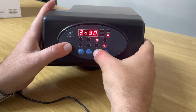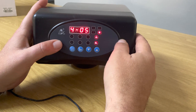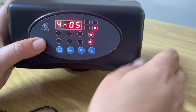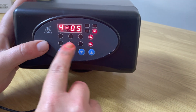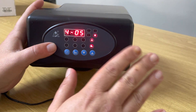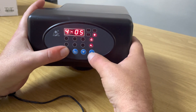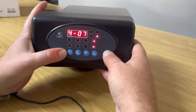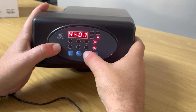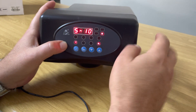This is your brine refill setting — this is when the head refills the brine tank with water again. Generally you'll leave it at 5 minutes and won't need to adjust it much. But if you wanted to set it to, say, 7 minutes, press the square button, take it up to 7 minutes, press square to confirm, and it's set at 7 minutes.